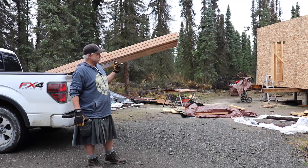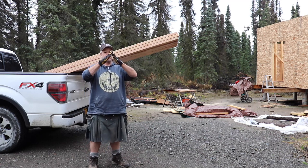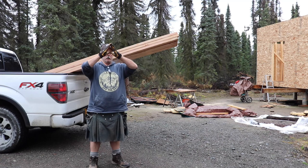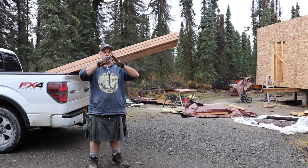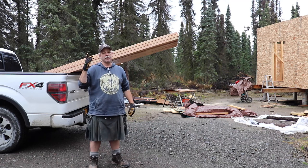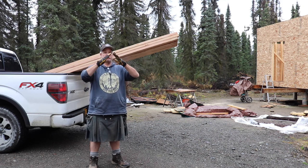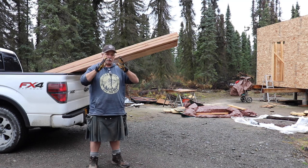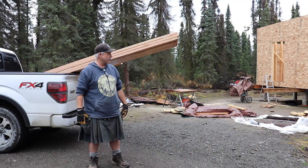And most importantly, when you put a roof on a place and you've got the walls down here, right? The roof wants to go out. It wants to push everything out, and that's how it holds itself in place, especially the rafters with the ridge beam that I'm going to do. It holds the ridge beam in place by pushing against it and forcing down on the bird's mouth on the top of the wall, and I don't want that wall to spread when I do get snow on there.